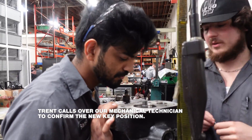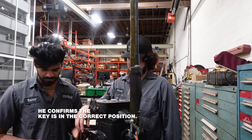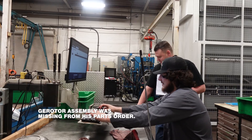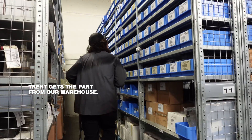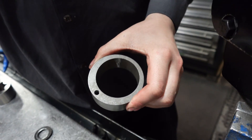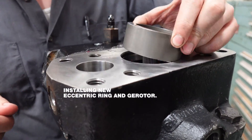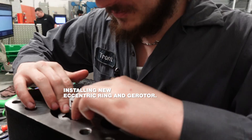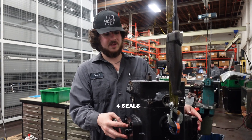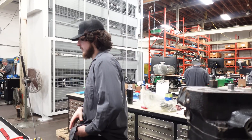Looking at this, it's a great hand — I want this at 9 o'clock, brand new. On these cams, you always want to make sure your threads are up so you can always pull your pin out and put a bolt in to take this out. For seal kits on these, there are about 20 seals just in this control, 4 in this, and I think there's like 15 in here — so that's just 3 things and that's already up to almost a full kit.